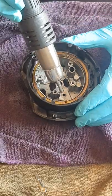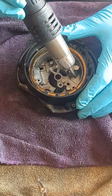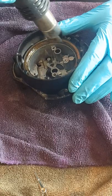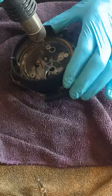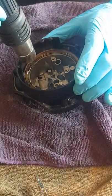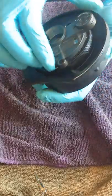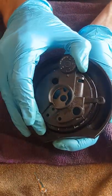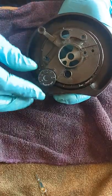What I'm doing now is heating the threads up. There the grease is, and hopefully the heat will melt the grease — combined with the WD-40 it should free it off. I'll give that a go and see if it needs any more heat. Here it comes — as I'm pulling that round, it's moving and it's freeing off. Now it's free — that's free from there.